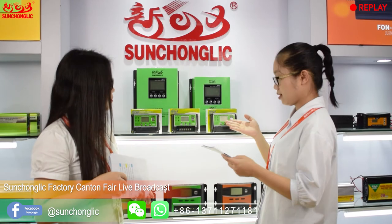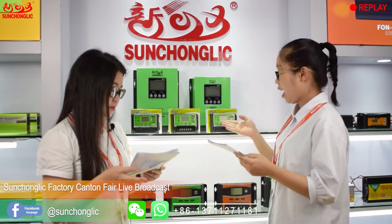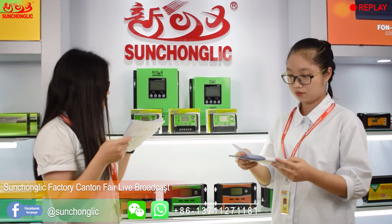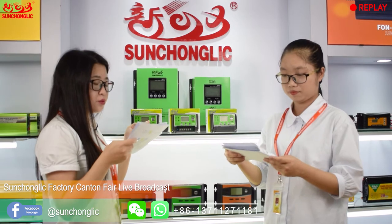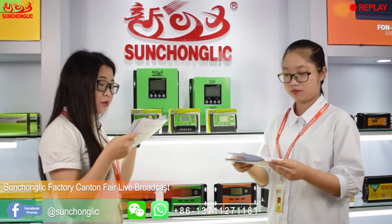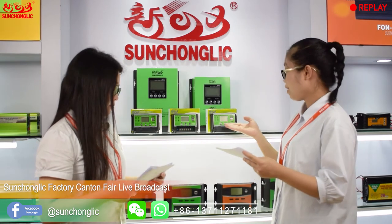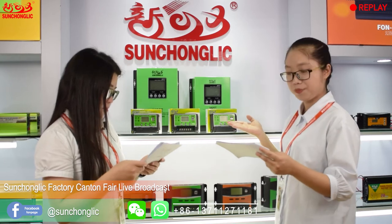You can also see in the middle it has a large screen LCD displayer that can fully show the charging and discharging parameters. There are three buttons here. On the left, this button is the menu — you can set up programs. On the middle and right are up and down buttons to choose programs. As for the dual USB interface, it is DC 5V and 2A — you can charge your mobile. There are two types of solar controllers: PWM and MPPT. Our FTC and FTS are PWM type, with a solar energy conversion rate of about 80%.